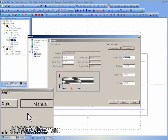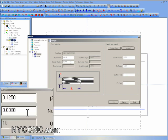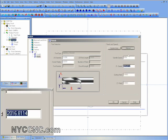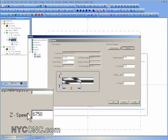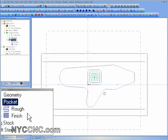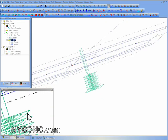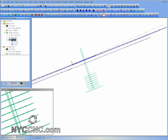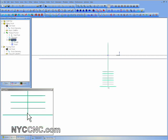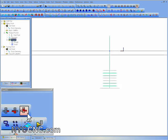It's a 1/8-inch end mill. I'm going to run 6,750 RPM, 7 inches per minute on movement, and 1 inch per minute on the vertical feed. I'm also going to create a finish pass with the same feeds and speeds — 7 inches per minute, 1 inch per minute on the Z. I right-click and choose Compute Toolpath, and you'll see the green lines don't start until a quarter of an inch down — there's a gap right there. Then there are pretty conservative increments of .03 inches each as it mills all the way down to the bottom, and when it gets there it will take a slightly larger profile cut all the way around the part to true up the edges.